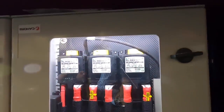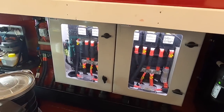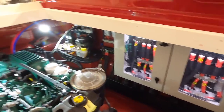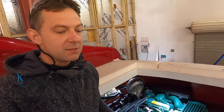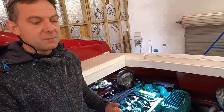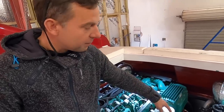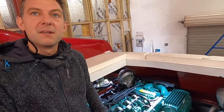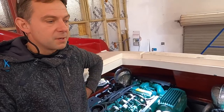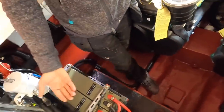In those two cabinets there's split charging for both engines and electric battery switches. It's all lit in here — it comes apart from being practical, it sort of shows it all off. To have it neat like that it's a little bit on display as well as functional. I like to keep the engine room clean — having it all in boxes means you can rinse the engine room out with a fresh water tap and a gulper pump at the back gets rid of the water. That was another reason to have delicate electrical stuff in the cabinets.